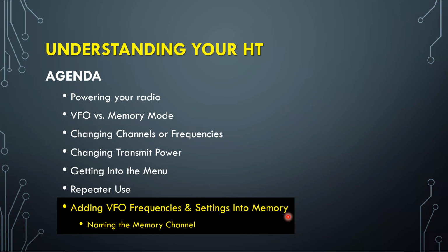Okay, so read that first sentence that you gave. The 447.1? What's the output frequency? 442.1. That is what he's transmitting on. It's the other way around. The output is 447.1. Output of the repeater. Yes, that is from the repeater. And the input is 442.1. That's what you're transmitting on. Okay. So your transmit is the 442, and your receive is the 447.